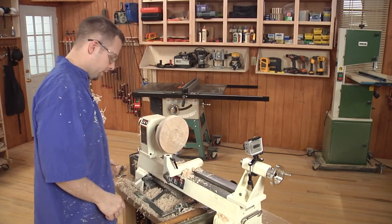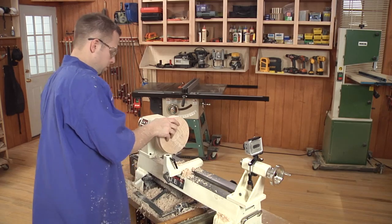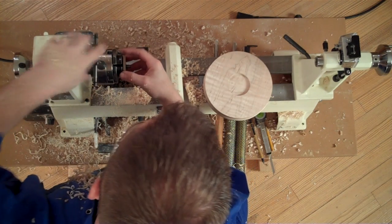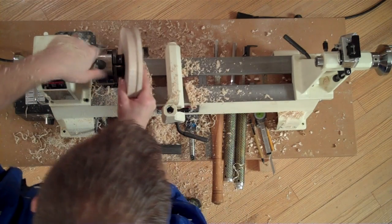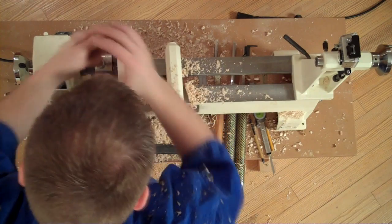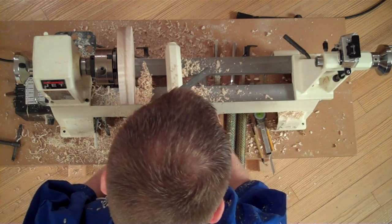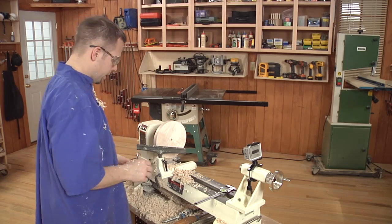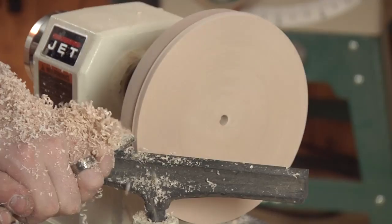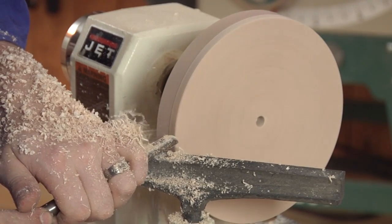The bottom of the base is now complete. We'll remove the blank from the screw, remove the screw center from the chuck, and install the blank by expanding the jaws of the chuck into the recess we formed. It's running true. I'm going to begin by removing the rest of this outside edge — I didn't do that earlier because I didn't want to split out the fibers as I neared the edge. Now I can use the same technique, cutting from right to left and matching the two diameters.